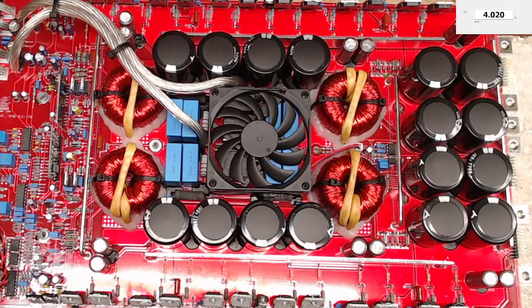So the first three here, you'll see that we're at 16K, 16K, and then the next three is 8K, 9K, as it charges the capacitor. So I'm looking for 16 and 8. So 1, 2, 3, 1, 2, 3. So this is going to be the first set here. 8, 9, 8, and then 16. Yep, and then 16. All right. So this side is good here. So what I'm looking for is 8K and 16K. And that's with the ground, the black terminal of the meter, going to the gate.